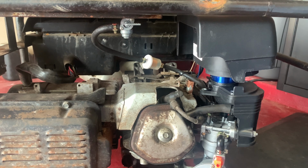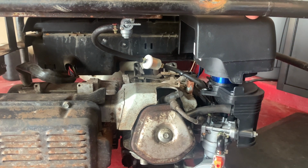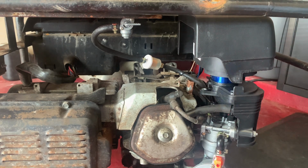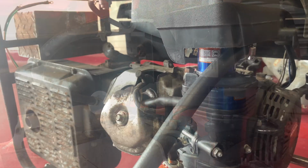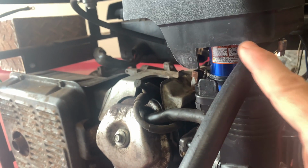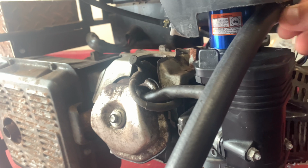It's almost like it needs a little bit of a spacer for this air box. I mean, it tightens up solid. Looks like it's making a really good seal there. Yeah, and I got clearance now. That should work. All right, so it took a little bit of finagling to get the fitment of this hose routed properly, cutting that for clearance. Everything seems to be tightened down.